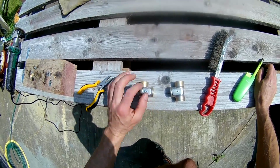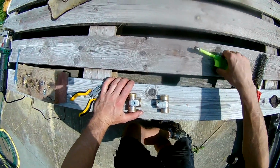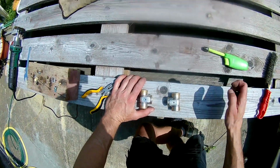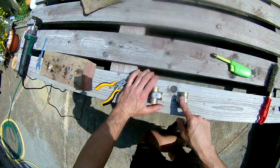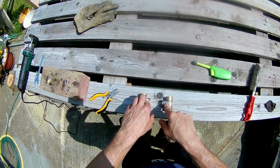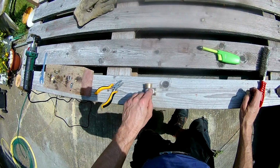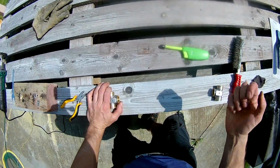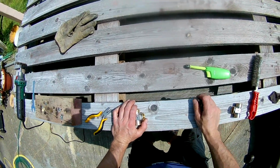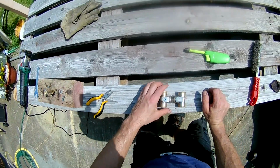And the sense is that I'm using two sensors just to program something like that. If one sensor is broken, that it's going down or something happens with the sensor, I can automatically detect due to deviation or very high level of deviation between these two sensors. One sensor is broken, it will be constant the value, and another sensor will be changing the value. I automatically can detect this as an alarm situation, and I can raise an alarm, and it's quite good to have two sensors and one program.